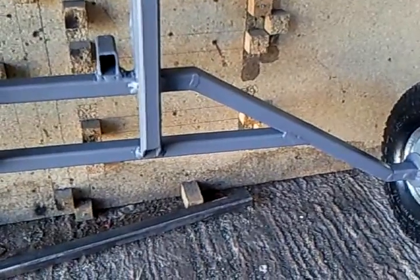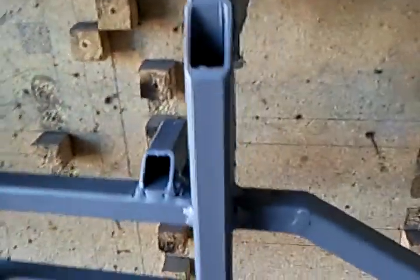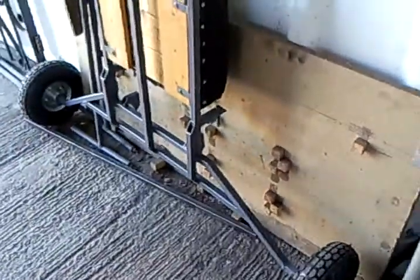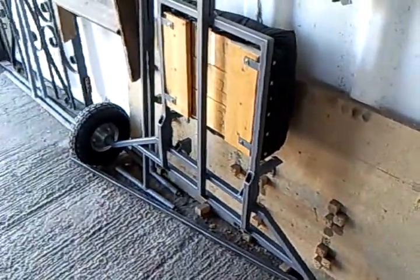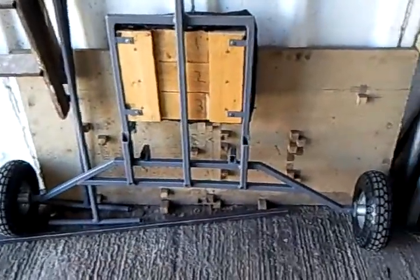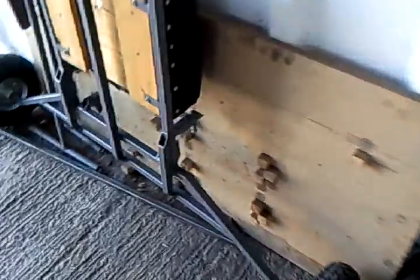There's a strengthening cross member because there's a bit of a torsional effect going on when you're sat on it. For some added strength I've just put that on, and then a long one running right down the centre gives you some extra strength and it feels a lot sturdier now. Probably not a sufficient test really, but I've dropped it from four feet and it bounced. Nothing broke, so definitely a lot stronger than what it was before.